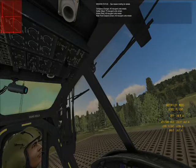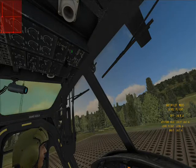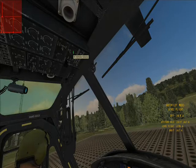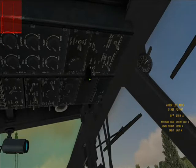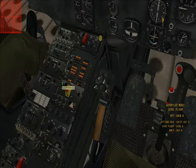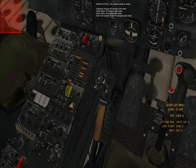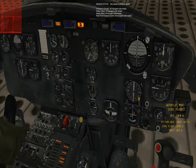We're going to look up at the center console. As we look at the center console, we're going to turn our battery switches to AC and DC — DC non-essential bus and AC, AC phase. And then we're going to turn on the battery switch next to the starter switch because the generator is already in starter mode. Once we do that, we go back down to the main console. There's a horn silencer — shut that off. We'll turn on our fuel, both of them. There's a couple switches up here: hydraulic control and trim, force trim — we want them both on.